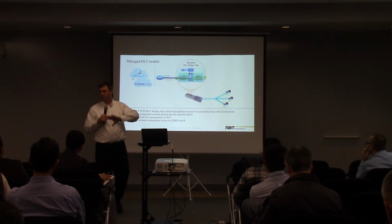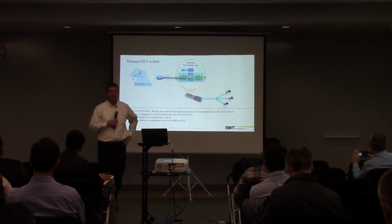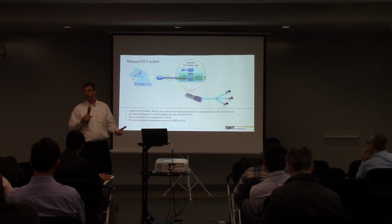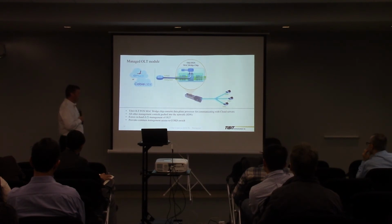So that was a lot about hardware. Like I said, I think this is important, even though I'm talking about some really specific things we do in the design. I think the things that we put together in CORD really do need to meet some of those metrics of reducing CapEx and making this a more efficient solution from a cost perspective, from an implementation perspective in the network. But the result is, like I talked about, you now have this device that is hosted on a common switch, plugged into an SFP+ port on a 10 gig switch, which must be remote managed, right? You don't have any other options this way.